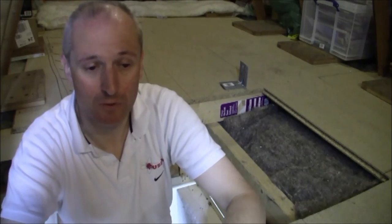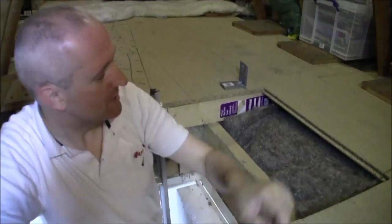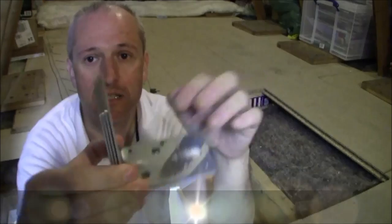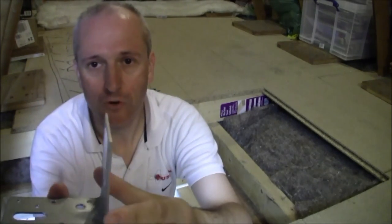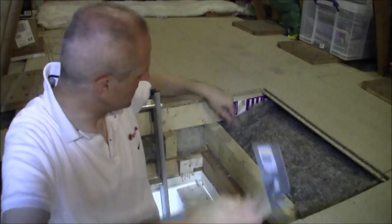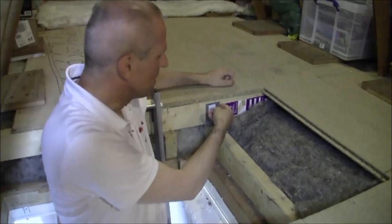You just can't lay pieces of wood across your attic and expect it to be stable — as we floored on top it would just fall over, so everything has to be bolted down. At a DIY department like Wickes we bought roofing brackets — they are steel, relatively cheap. When you fix the first layer of wood across the joisting you fix the two together, drilling two holes and driving screws in.